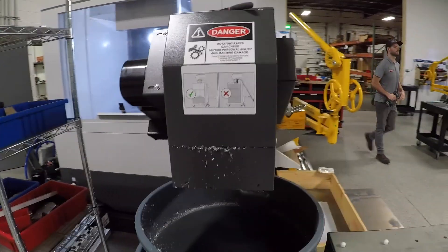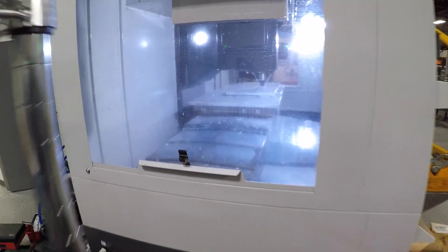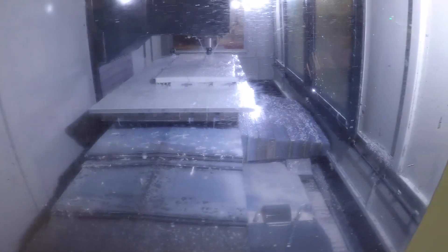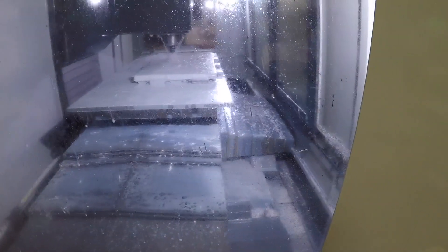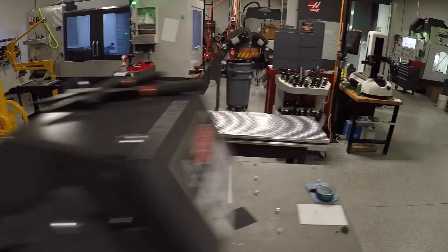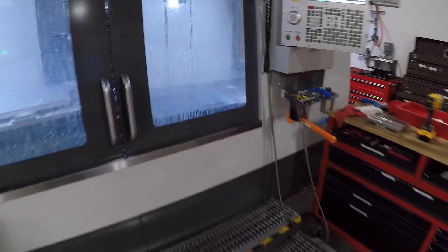I've also been working on some different designs to improve the chip evacuation on our Haas machines. We really don't want all these chips building up in the corners. We don't mind doing a quick hose down at the end of the day, but I want that to be a lot faster. We started 3D printing to fail fast, fail cheap, and they're actually holding up quite well. You saw there was one right in the front on the Y-axis saddle that helps minimize the surface area and creates a steeper section of geometry. Some chips will still build up, but once you hit it with coolant it goes away real quick.